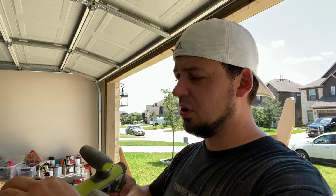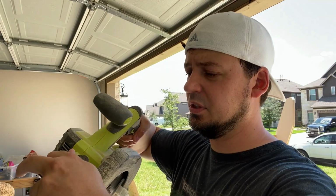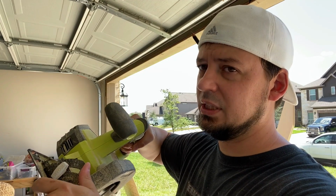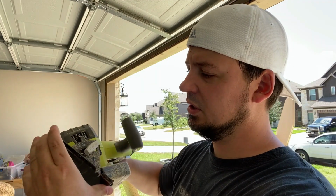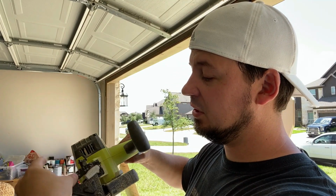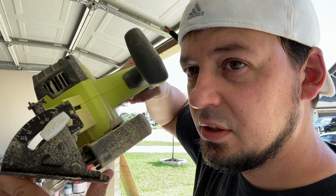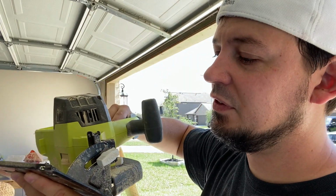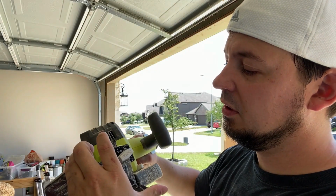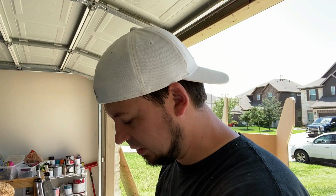Now, with a circular saw, there's usually an adjustment setting here. So you loosen that and you tilt until you get to that. Make sure it says 45 degrees. There's sawdust in there so you can't see it. Right, so that's at 50 degrees. We don't want a 50 degree angle. We want a 45 degree angle. And you want to tighten that all the way.